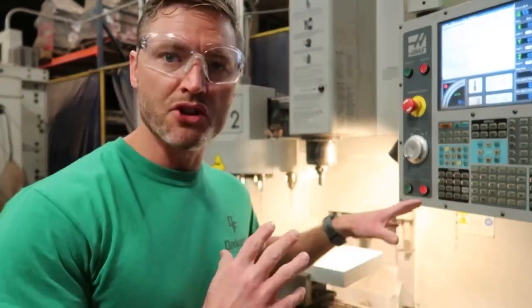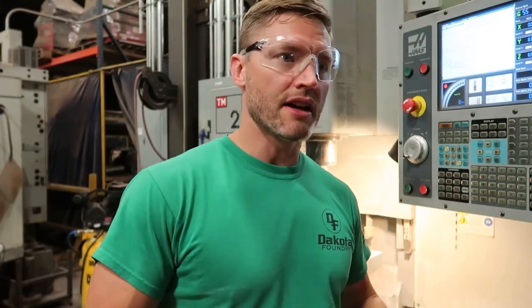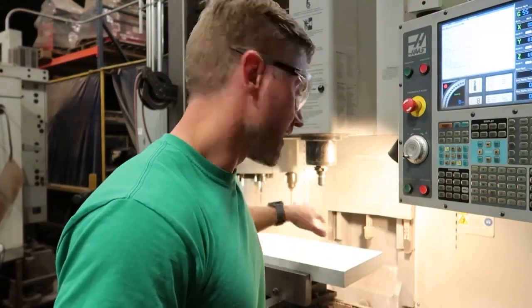The reason I have the small dual compressor running is because I'm going to run this machine lights out all night. I don't need my 50-horse screw compressor fueling this 34,000 square-foot shop with air when all I'm doing is running one machine. So I'm running one machine with this little DeWalt small compressor — air leaks and running a big screw compressor all cost money. If you want to make money, you've got to think about costs and efficiency.